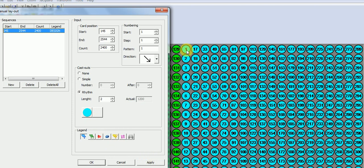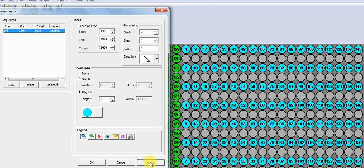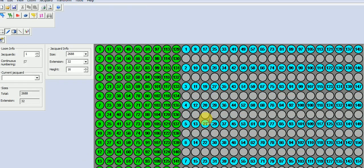What will happen here, every alternate end will be empty. You just check, this will happen here. Now check carefully, see, 8 means 1 2 3 4, but hook number 1 is drawn with warp thread, the other hook is empty. In this hook there is no warp end. If you take full of this, you get 168 ends per inch.